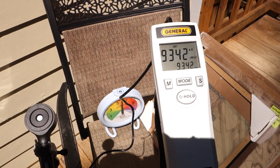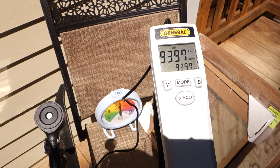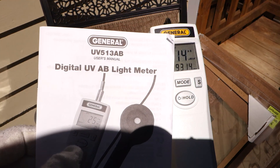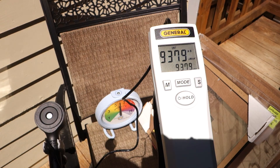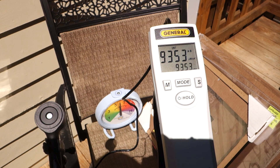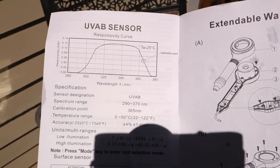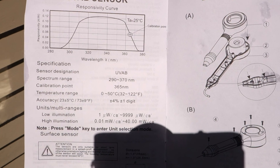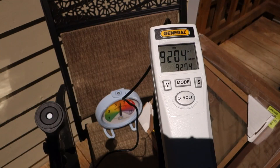This is the sensor — the sensing unit right down here — and this is the display showing what it's actually reading right now. The luminosity is measured in microwatts per centimeter squared. The device is a General UV 513AB and it's got this interesting curve in the manual that basically shows what the device measures in terms of the wavelengths it's sensitive to — basically UV between 290 and 370 nanometers.